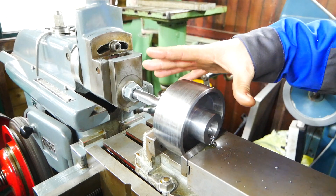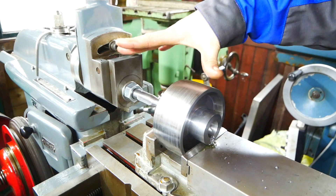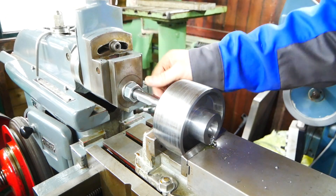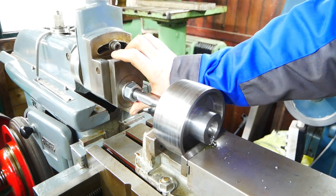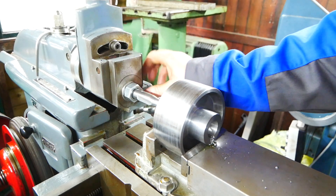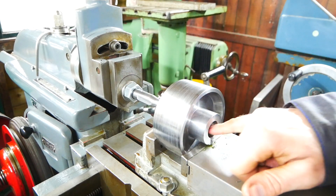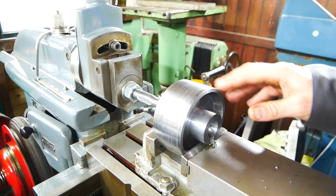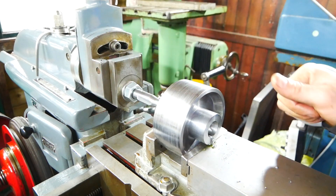Okay, first test cut — or it's not a test cut, it's for a part for the belt grinder. I noticed that the clapper box needs some pressure downwards. Maybe the arm is too long, or maybe the keyway cutting does need a fixed tool — I don't know, maybe you guys have any idea. But if I put some pressure on here, then it works okay. The cutting itself is C45 steel, works okay. Let's think of something to hold the clapper box and then cut the keyway.